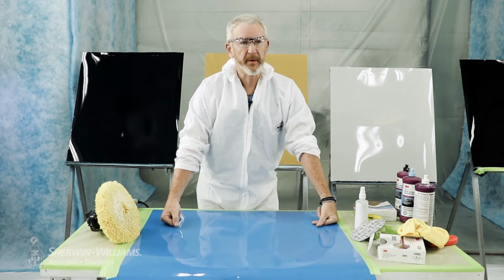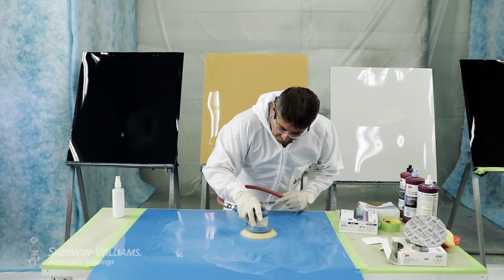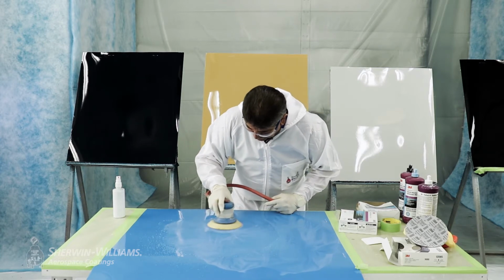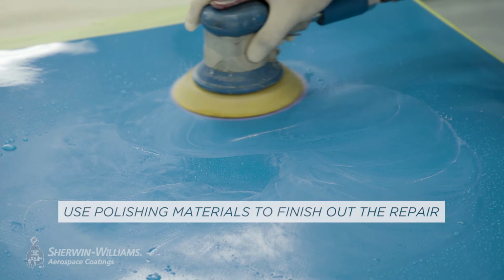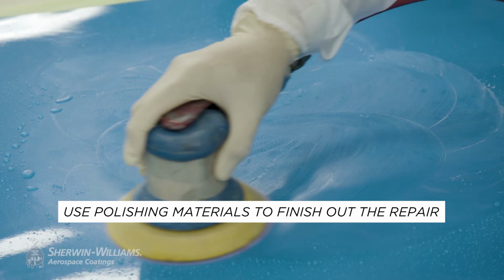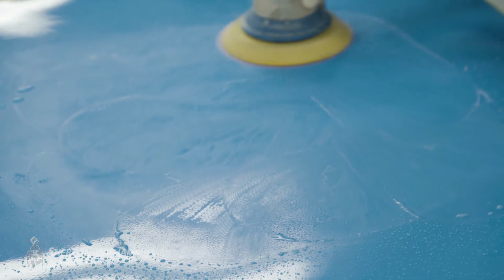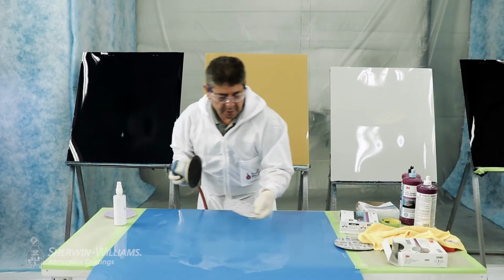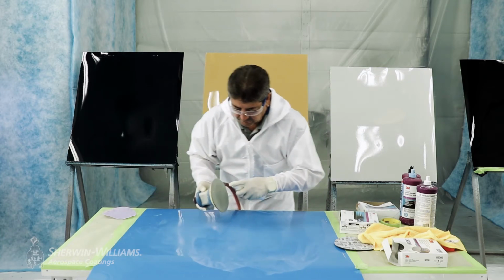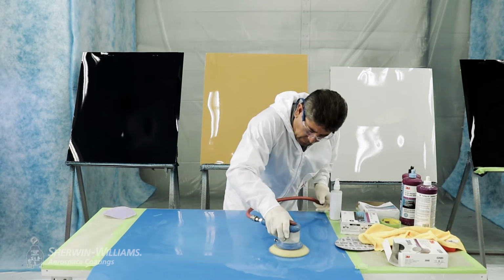a successful repair. The fresh CM0850180 can be successfully spot repaired using the blend technique. What we're doing to recover the gloss is we're first sanding with P1500 using water as a lubricant. We sand the spot repair itself into the body of the original clear. That's followed by P3000, again using water as a lubricant. That's sanded over the 1500 to get rid of those 1500 scratches into the original body of the clear.